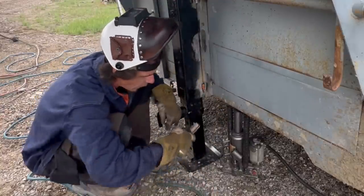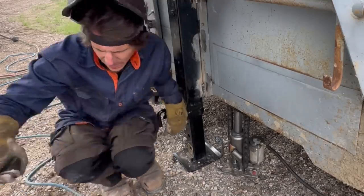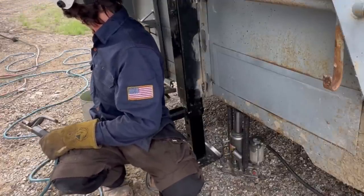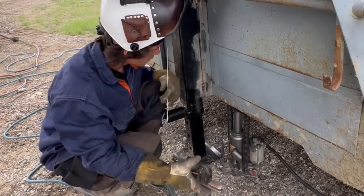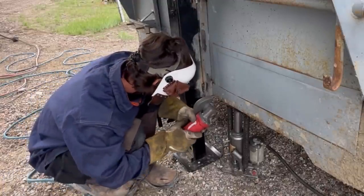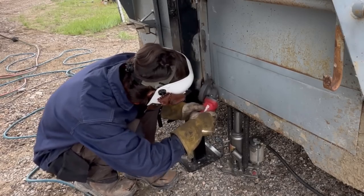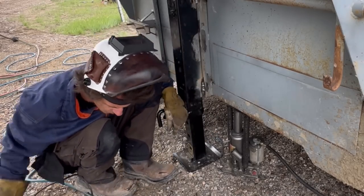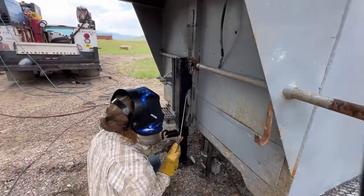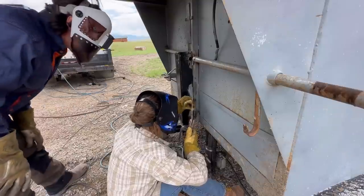And you see when I struck off how I pulled? Yeah. It's because I intentionally wanted to leave a divot. And the reason I wanted to leave a divot is because now I should be able to make my next weld blend. So of course I'm gonna wire wheel that before I restrike. So it doesn't look that great, but that's because I was trying to fill your stuff in. So start around here. So start where you're comfortable. And then, just like I said, just very small weave motions. You were just a little too exaggerated last time.